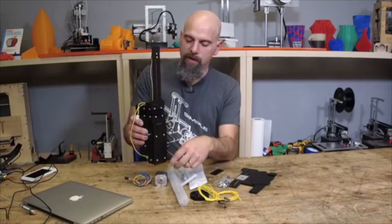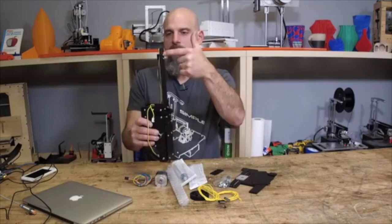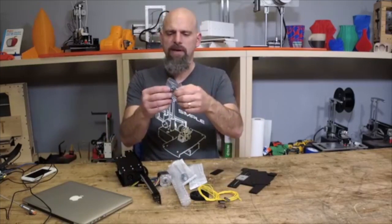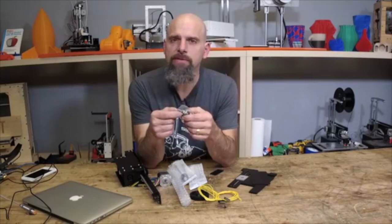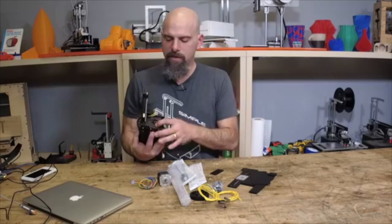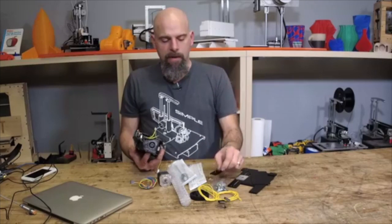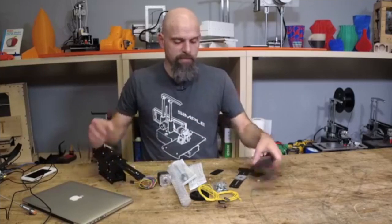It starts there and there's no homing — you don't use the end stops for that. The only end stops being used are E-min and E-max, so those come with it. Some of this hardware is specialized — these are plastites, designed to screw into 3D printed plastic parts and grip really well. You'll have to follow my instructions: we want these printed parts to be very strong and have lots of material to accept the plastites. You will have to print with high infill so it's very strong. And then these beautiful powder-coated plates.